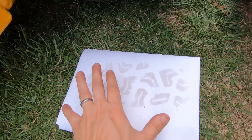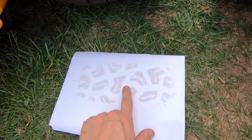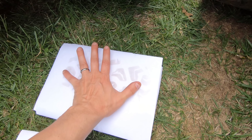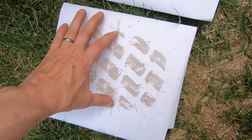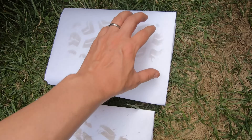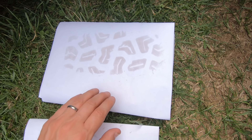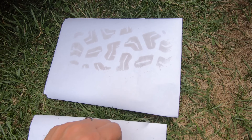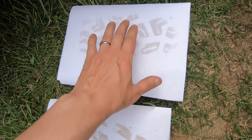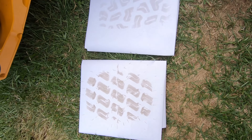Now let's talk about ground contact or ground pressure. Both of these tires have different nominal sizes — the tweel was a 26x12 and the air tire was a 26x14. Where the tire hits the ground, there's a very similar amount of ground contact width. The air tire had a longer contact with the ground and a little more circular — kind of like a balloon pressing against the ground. The tweel has a more cylindrical contact patch because of its cylindrical construction. At this air pressure, the air tire probably had slightly lower ground pressure than the tweel, but it depends on the specific air tire size and pressure compared to the tweel being substituted.